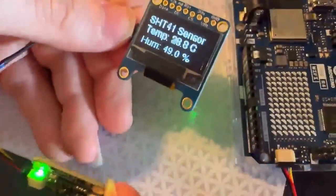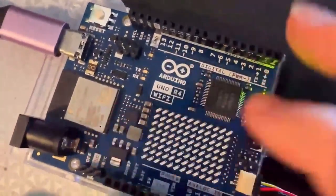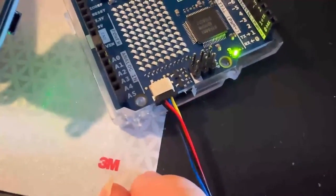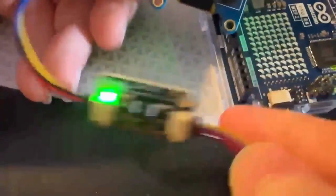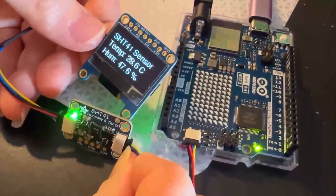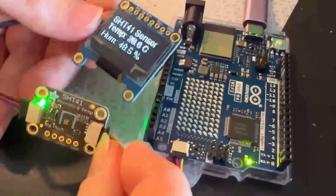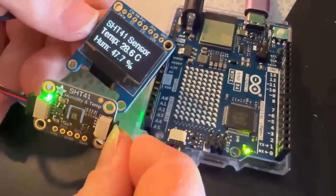We just got one of the new Arduino Uno R4 WiFi boards. In addition to some cool LEDs and WiFi via ESP, there's also a STEMMA QT port which is compatible with our STEMMA QT boards, so you can plug and play. It's really great for IoT because you've got the WiFi, a powerful ARM core chip, and you can just plug in a temperature and humidity sensor or OLED with no soldering required. So you could upload to Adafruit IO, the Adafruit cloud, or AWS without any soldering. We're really getting to a next generation of IoT platforms where anyone can get data and upload it to the internet without coding and without soldering.